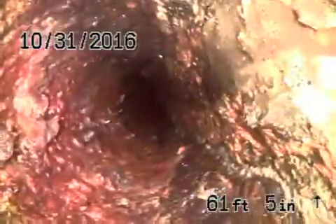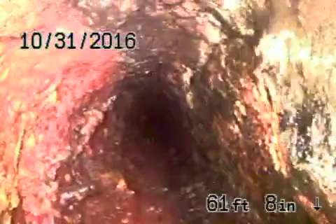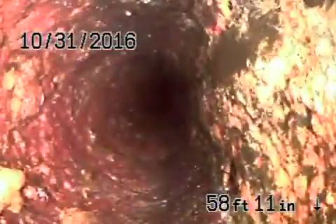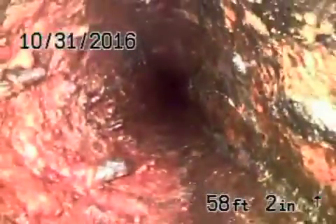They replaced a lot of the piping underneath the house. This cast iron pipe is very old and I'm definitely going to recommend that it be replaced using a pipe bursting system where you can burst it out and put a brand new polyethylene pipe in. Very poor condition — look at the rust build-up in it.